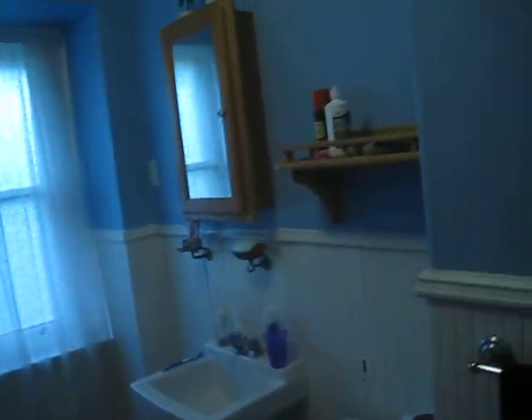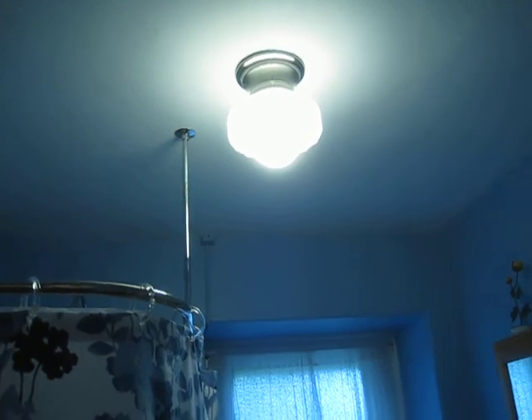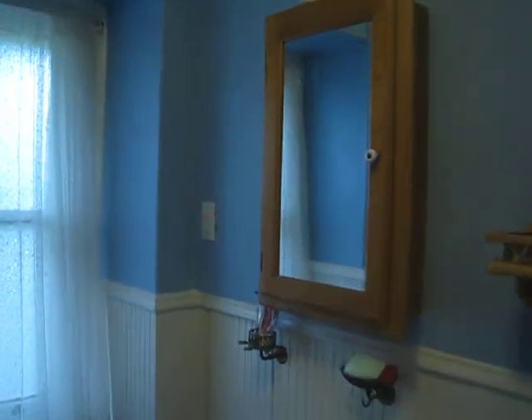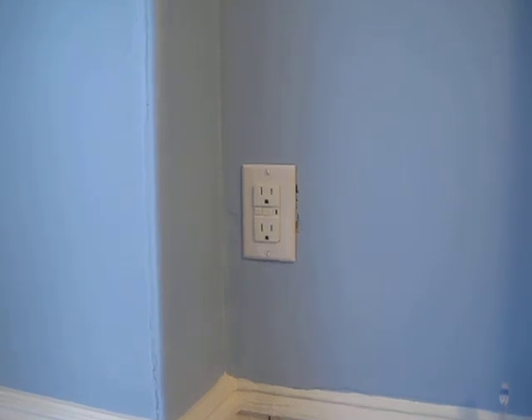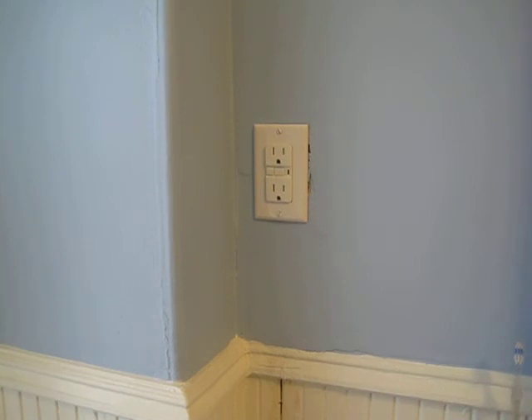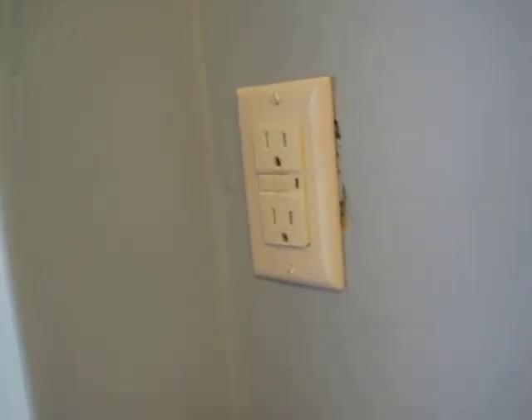Since it wasn't an opening-walls renovation, smoke detectors were not required to be newly installed, and the owners chose not to pay for newly installed hardwired detectors. In the bathroom, we added a GFCI receptacle, coordinating with paint and working at the same time as painters and plasterers, rather than coming before them. I left a few dings here and there that can be fixed by the painter-plasterers as they come back through after me.